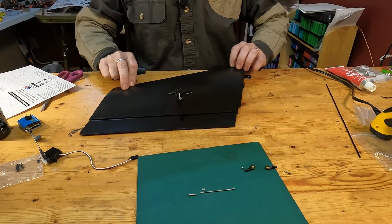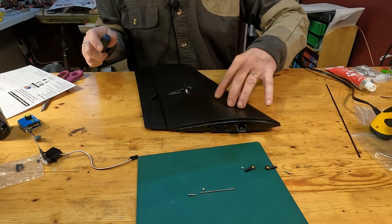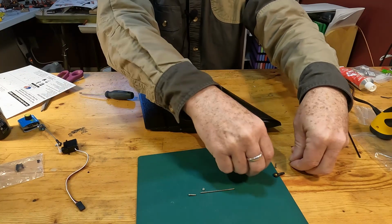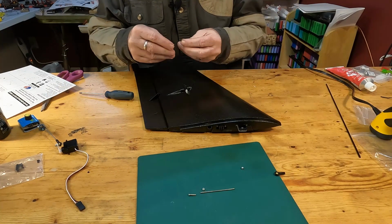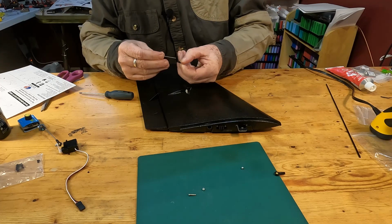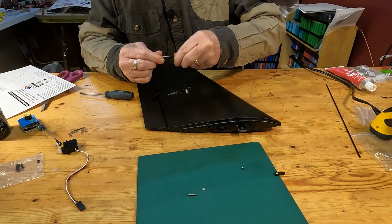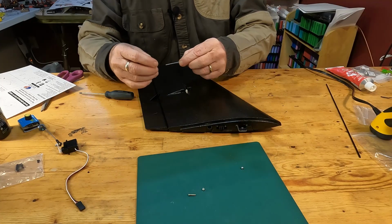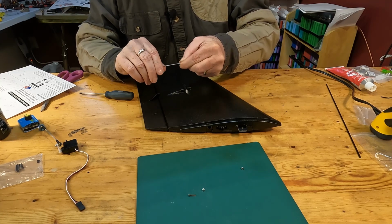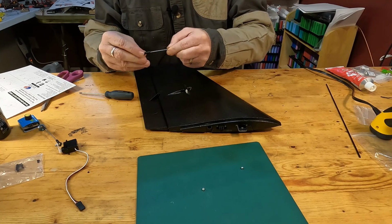Okay. Now we can see that from here we have that servo arm that sticks up. We will be able to attach, like we see on here, the bar to and from. I'm just very loose fitting this right now. This is not the finished job. These simply thread together. Do it carefully so you don't cross thread and strip things out. This is plastic. Anytime you're working plastic and metal together, the metal can destroy it if you're not careful, so just be careful with it. Now this is just very, very loose. This is going to need further adjustment as we finish things off later.